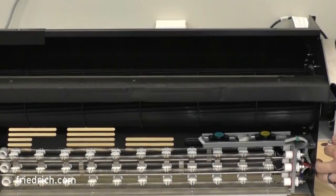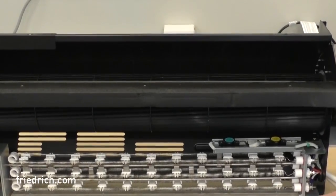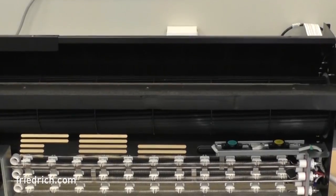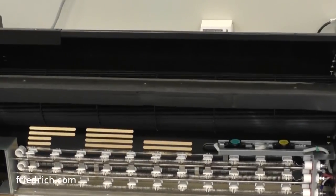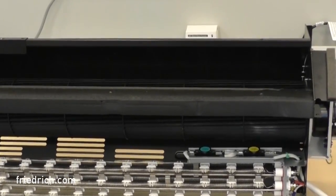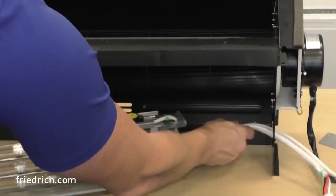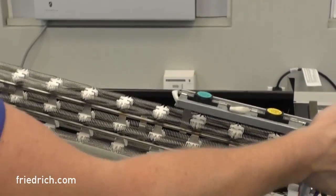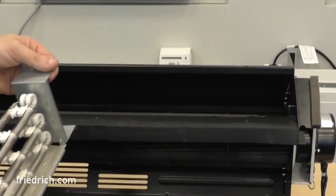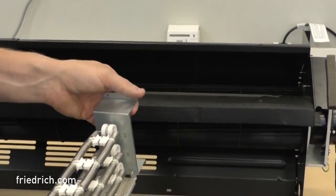On the right-hand side by the motor, there's also a protective plate that goes over the outlet for your harnesses — it just clicks into place. Once I loosen the screws, that will pop off. Now that I've removed all of those, I can simply grasp the heater, pull towards myself, slide the wires through the hole, and now you have your heating element removed. If you have your replacement heater, you're going to do the exact same process in reverse and you'll be able to rebuild this unit, finish the call, and get on to the next one.